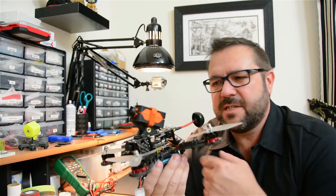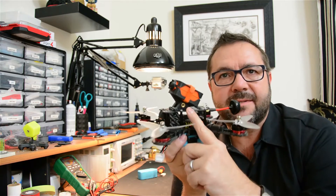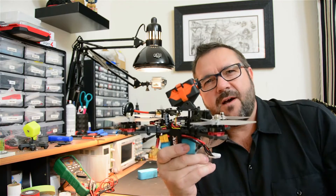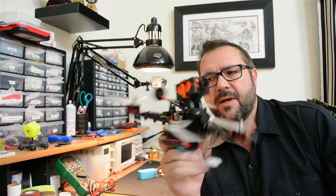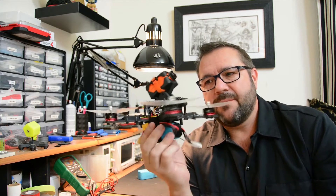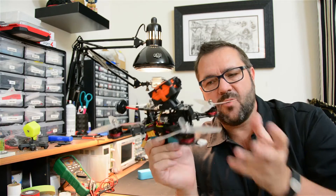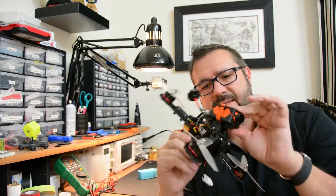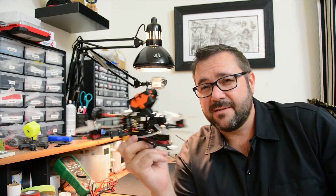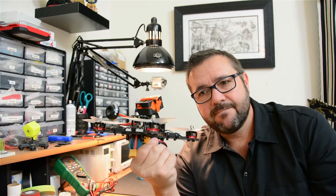We finished the assembly using brass threaded inserts to attach the base to the front — that gives a really strong connection. There's an Allen head bolt, it's very tight, clean, and protected from the elements. It's adjustable from 35 to 40 degrees in both directions. The only change to my drone configuration is now I've got the battery on the bottom. I'll have to get used to the new flight characteristics and continue tuning. In terms of center of gravity, I don't think it offset it too much since we kind of counterbalanced it. It turned out great, and I look forward to shooting some footage — that will also help me tune it better because you can see the fluctuations and how the airframe responds based on my input.